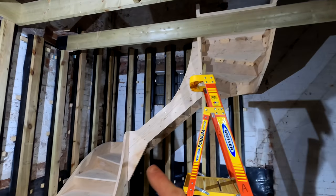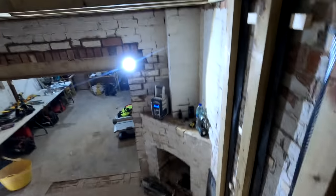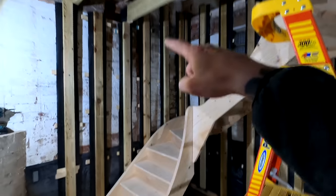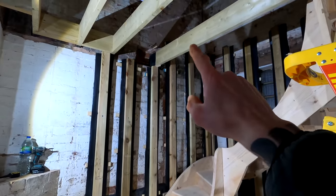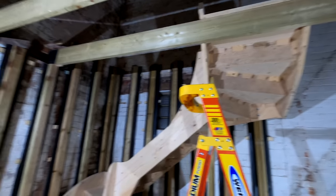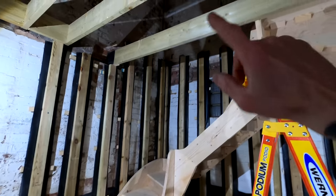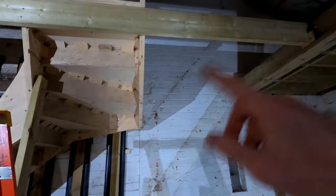The order of business today is to get this staircase finalised. What we need to do is move this joist, because we need two metres from this point for head height, and this is probably a little bit too low — so we need to raise that up. We can do that by moving this joist this way, putting a plate on the back of the case and bolting it all together. We're actually going to put a triple in here because of the length of the span, to make sure there's absolutely no flex whatsoever. That will give us enough head clearance coming up the stairs to make sure it passes building regs. Once that's sorted, we can start getting the rest of our joists in across here, get this all trimmed up, get the rest of our noggins in, and start getting some flooring down up there.